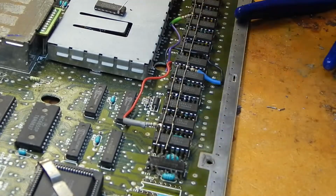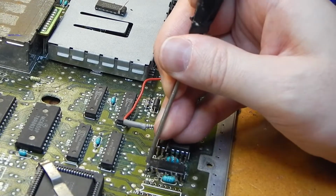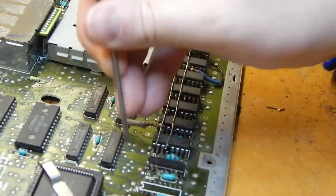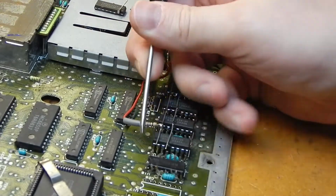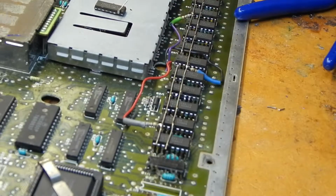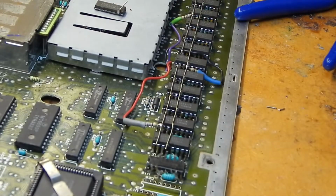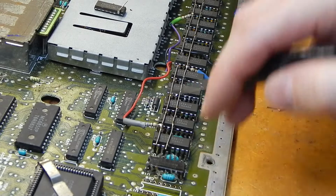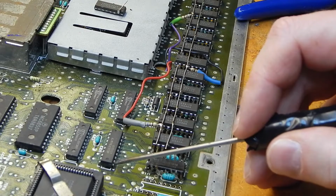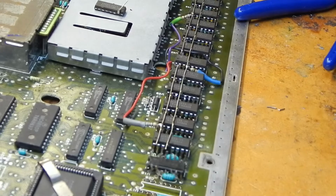I'm not cutting away these pins at all, because as I said in the previous video, if I chop that with the cutters, it'll bend the pin over, and with a lump of solder on it as well, the solder will bend, and the solder's obviously soldered to the pad, so it will rip the pad off. So I'm not going to snip this chip out and pull the pins out as I would ordinarily do with one of those chips that are just clean, where you could snip them all out, heat them up with a normal soldering iron and pull them out one at a time.